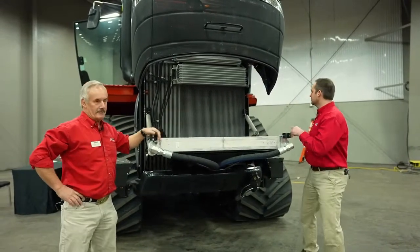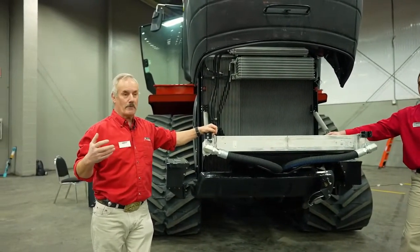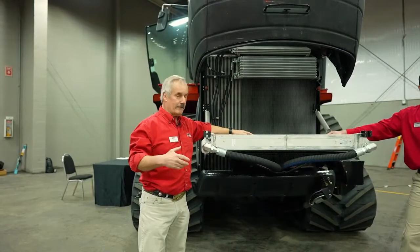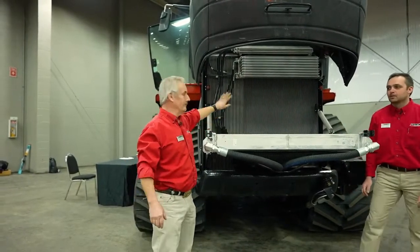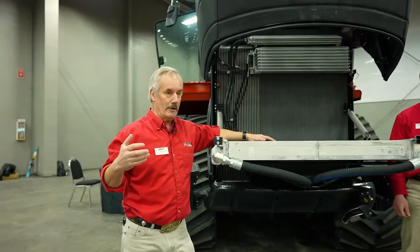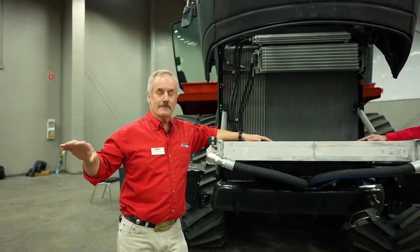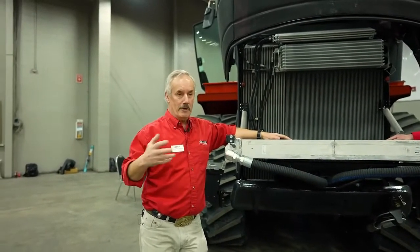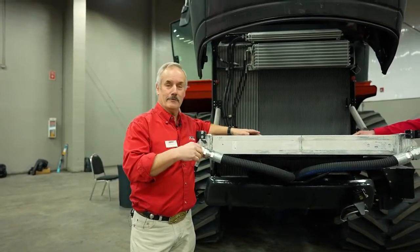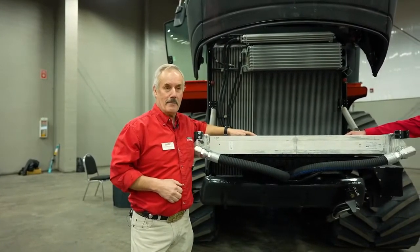The one thing I wanted to discuss is, when you're going through your tractors, you're going to open this up, and if it's not a new tractor, the radiator's probably going to be dirty, so you're probably going to have to get the power washer out and clean the coolers and radiators properly. One caution I always mention is, when you're putting water into a radiator, make sure that it dries up. Leave the tractor there, don't start it, let it dry up, so that there's no water caught inside the fins, which would dry up in there, and eventually dirt will accumulate onto those particles left on there. So wash it, let it dry up, then start her up, and you can get back to work.